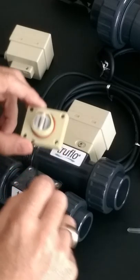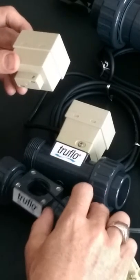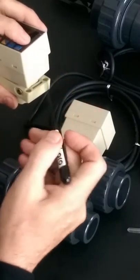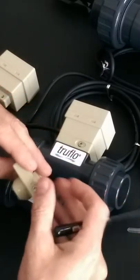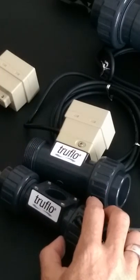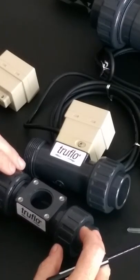The paddle itself is made from a very hard, extremely chemical resistant material called Tefzel. The shaft is zirconium ceramic, and inside the paddle itself you have zirconium ceramic bearings — ceramic against ceramic. Inside the paddle there are magnets which are designed to produce a Hall effect when they come close to the Hall effect sensor that is epoxied into the electronic housing. As the paddle spins, it picks up that signal and moves it up into the electronics, converting it into a flow signal.